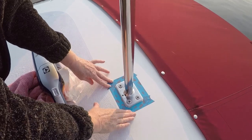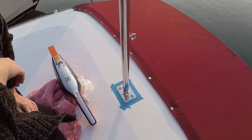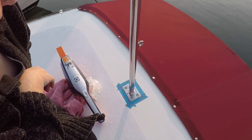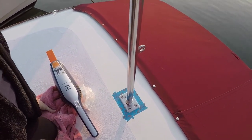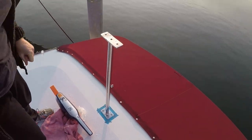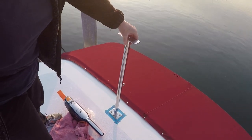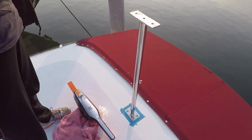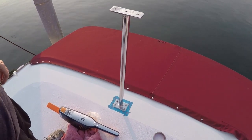Still working on the railing posts in the back — we're pretty slow at it. It's a matter of drilling a quarter-inch hole up from the bottom to place our holes, then the five-sixteenths hole down from the top to make sure we've got the bolts in the right place, stanchions in the right place. Then tape them all off, then bed and caulk, then bolt them down, then move on to the next one — then have a beer, then watch some more sailing videos online, then another beer, then more stanchions. We'll eventually get to all fifteen.